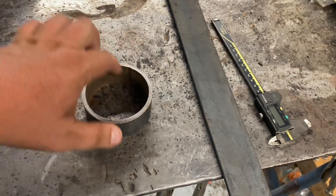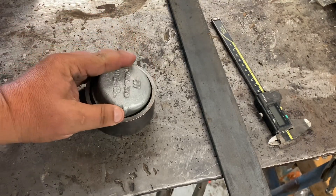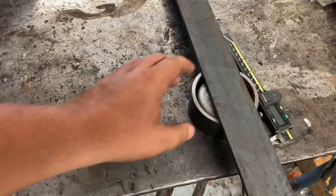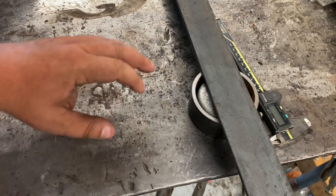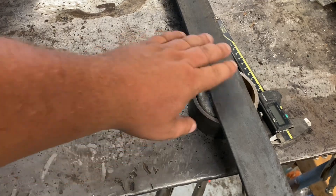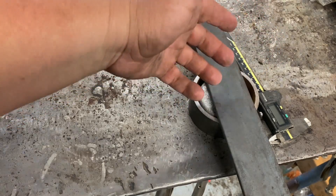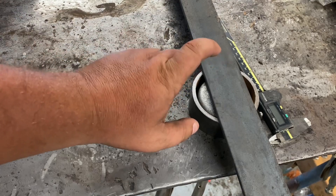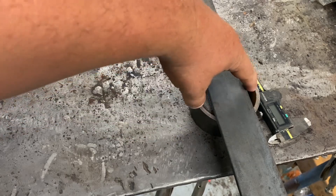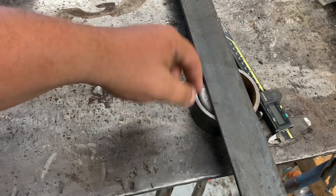Cut and deburred, and I do a little bit of cleaning on the inside. Here's our test cap — it fits in there nicely. I'm going to take a piece of steel and weld it over the top. I know some of you are wondering why not do a full cap — this is from knowledge. We're using tools like this and I want to have a place where you can push this through and it can expel muck, rust, or anything that might be in the tube with this cap. So you can push it down and turn it and work some of that stuff out through here. The key will get welded to here, and of course I'll cut this and round it and make it all look nice.